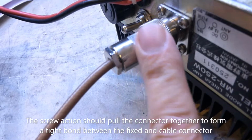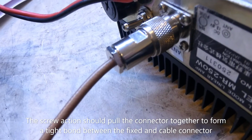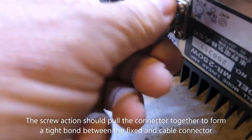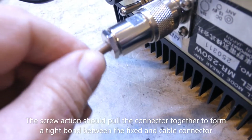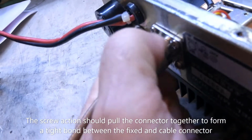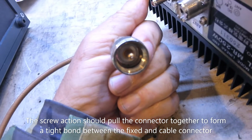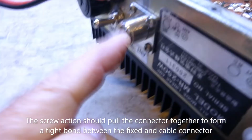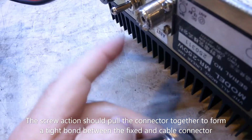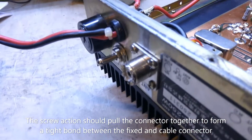But we have had this on our field day, where we pre-made cables, went out on the Jock White field day. This was in 2021, and we were really quite late getting into the field day that year because the leads we'd made up were all like this and would not tighten up. Even with pliers, we couldn't get a tight connection, and I can't undo that now. Hang on. And as I said in the previous segment, at the bottom of these connectors there are little raised pieces which locate in these slots, and that's how you get an earth connection through to the antenna, which isn't loose, doesn't flop about and lose its connection. So let me hook that up, we'll give it a drive and we'll see what happens.